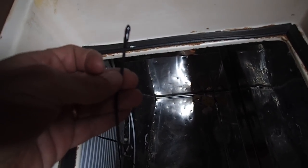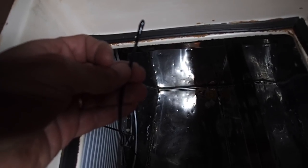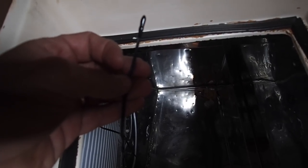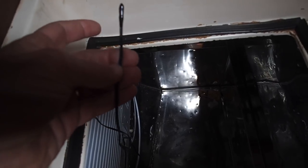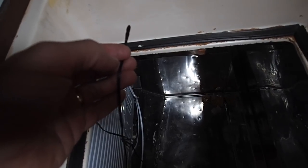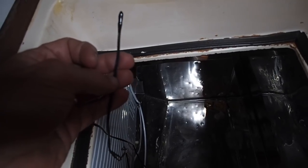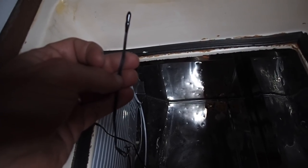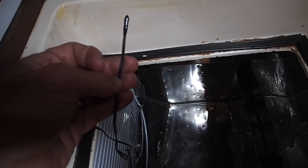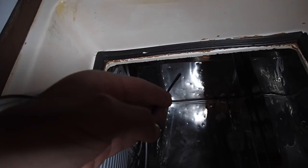A little update on the temperature sensor: the instructions indicate that you should bring the temperature sensor outside if you're installing the potentiometer inside the cabinet, and then bring it back in down low. I just called tech support for Webasto, who makes the Isotherm unit, and they said that is not necessary. It's really just an aesthetic thing. So if you don't mind having the wire run within your refrigerator, save yourself the hassle and just move it to the bottom, like we're going to do here.